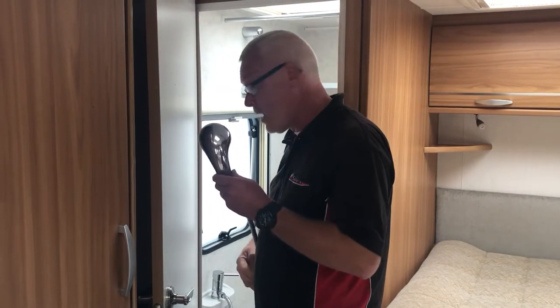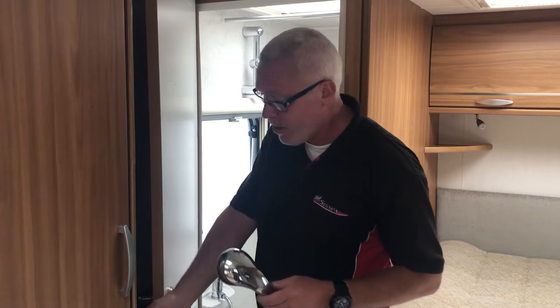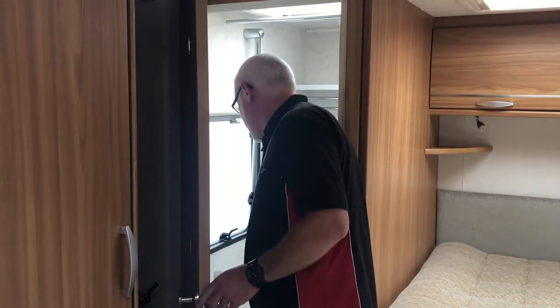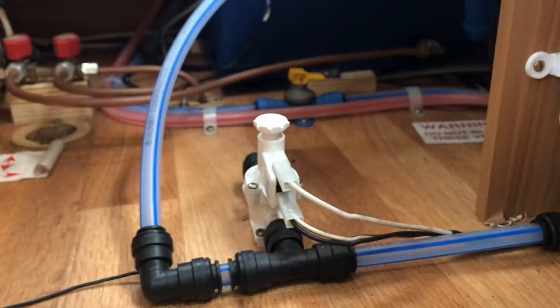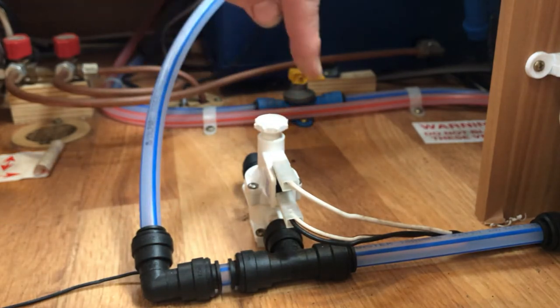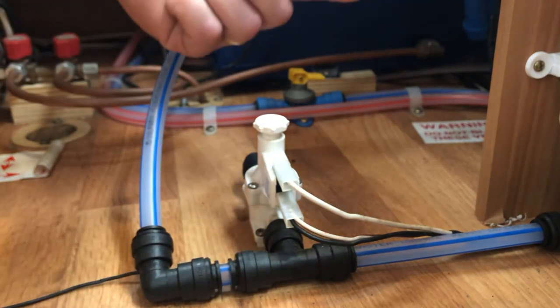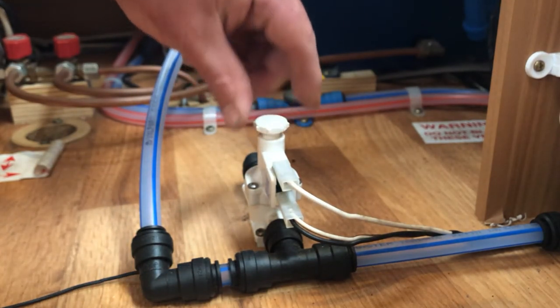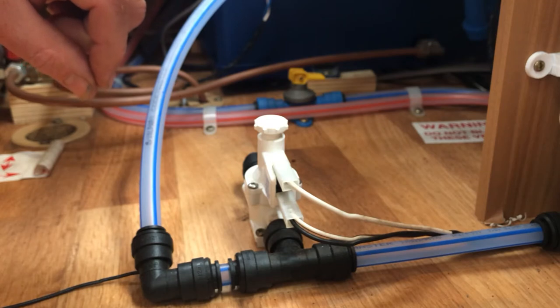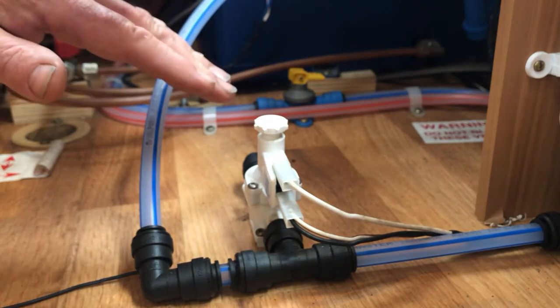I'm not going to flow the cold water into the shower tray because it's a bit of a mess, so I've placed the shower head into the sink next to the shower. I'll turn the cold water on, which makes the pressure switch click — that's not right, we need a constant flow. The pressure switch is clicking on and off, so what we need to do is turn it clockwise, winding it downwards, doing quarter turns at a time. What we want is continuous flow of water from the pump without cutting out. When it flows like that and doesn't cut out, it is correctly set.